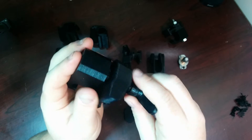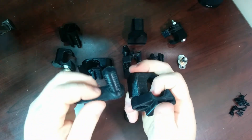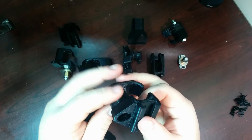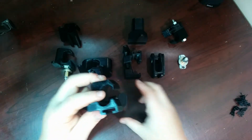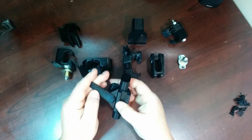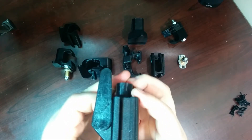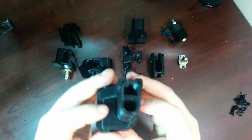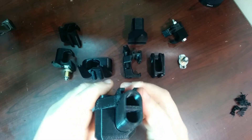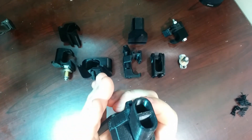So from this design, I did a little more research and came up with this one. This one is the same idea, but instead of four blades, there's only two blades now, as you can see. The design is much thinner. Just like the other one, you hold all three pieces, put it over the rail, slide it into place, and lock it down. It gave a pretty decent hold at the beginning, but over time it loosens up. This surface right here is not perpendicular to this plane, so it's applying a lot of stress right down at the root of the thread.